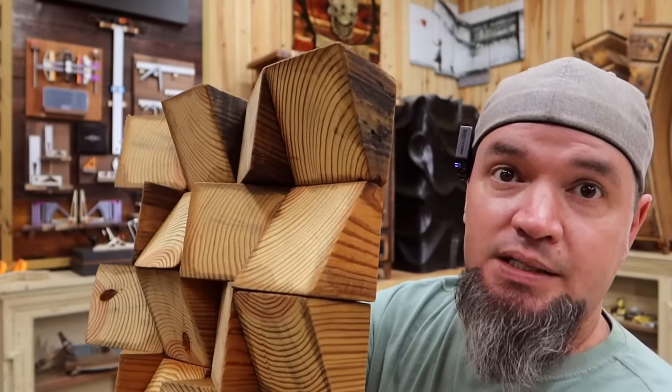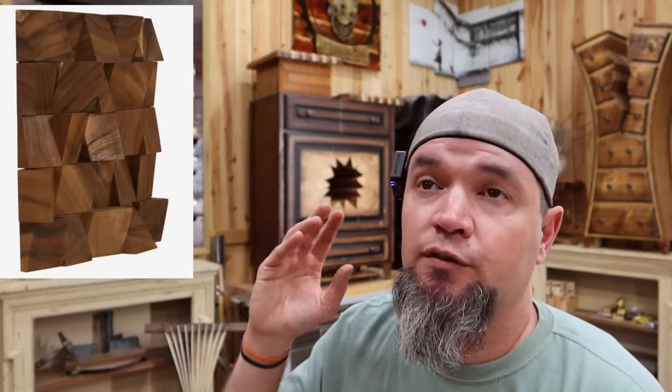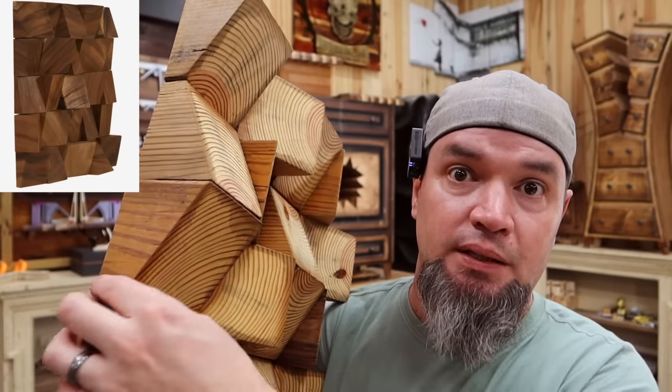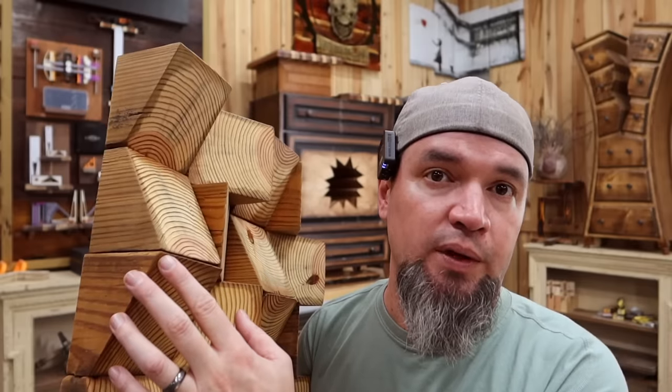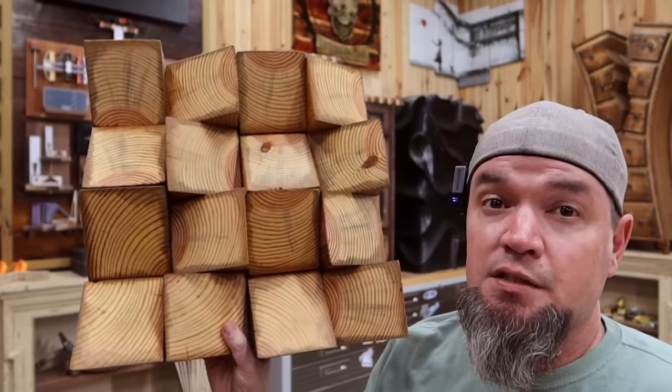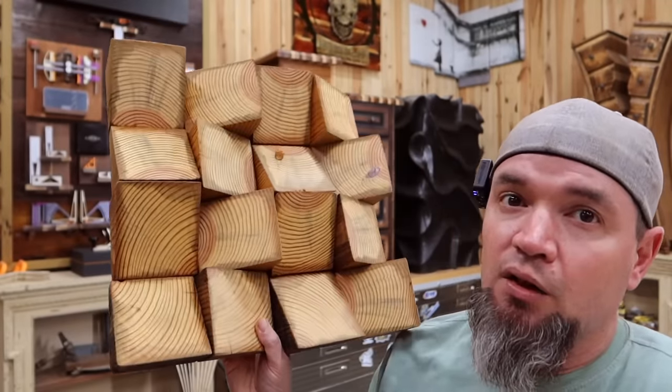I zoomed in and looked at what was going on with all the shapes — they're repeating patterns of the exact same block just laid in different directions. You can use a two-by-two, three-by-three, or four-by-four — it doesn't matter. The thinnest part of the wedge looks to be about an inch, and the description says it is three inches off the wall. So I cut from one inch to three inches on a miter saw set to 30 degrees. Each block takes about three to four minutes. Then I could see they had glued these to a quarter-inch piece of plywood with a wall hanger on the back. In about 15 minutes I took scrap wood and made something they sell for $180.